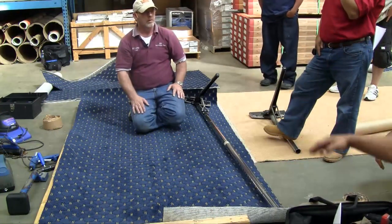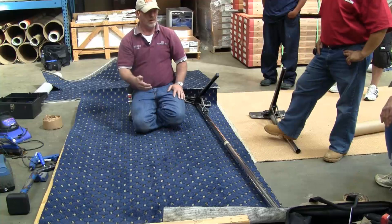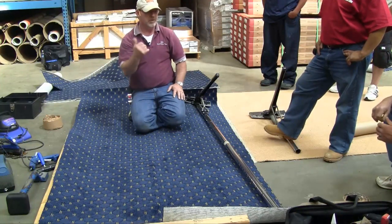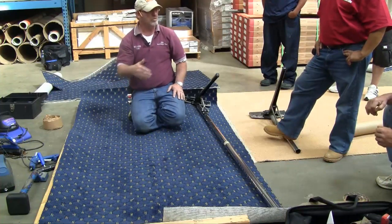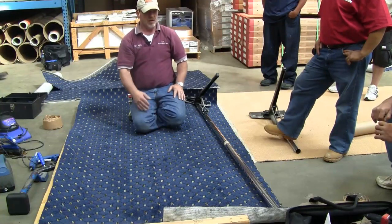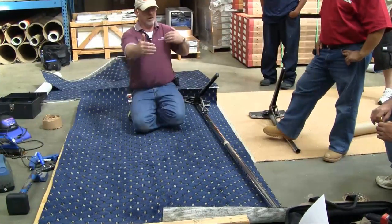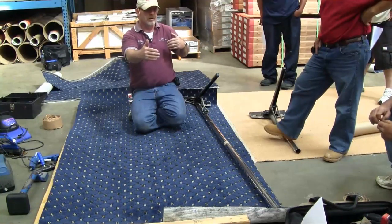If I had a big room and I rolled it out — say a room with a 20-foot long seam — and I'm only running three-quarters of an inch in 20 feet, I'll probably start at one end and work up. I can pull with the products and tools I have and move it along with no problem. But if I had 20 feet and two inches to deal with, then I'm going to start in the center and work an inch both ways. It all depends on what my pattern elongation is and how I'm going to work it.